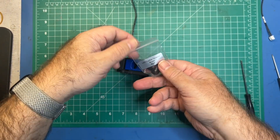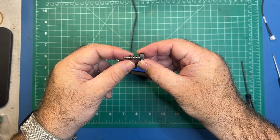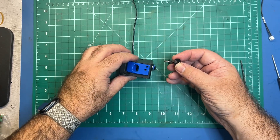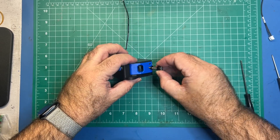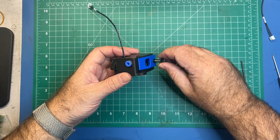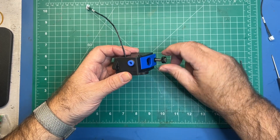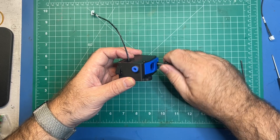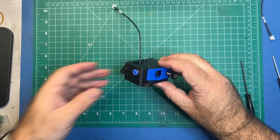Got the tensioner set. For the next step you're going to need this little washer, a spring, and the head. That's going to go into this heat insert — just drop it in. Once you feel it biting down on the screw, just turn it two and a half turns. We're going to adjust the tension in a minute.